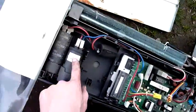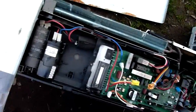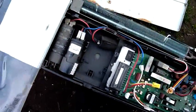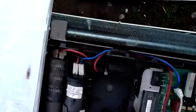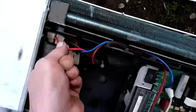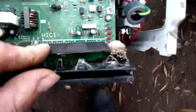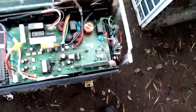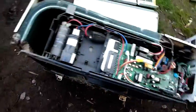Got some good caps — 180 volt, 75 microfarad, 1999. And a 400 volt 1500 microfarad Nippon Chemicon. Nippon Chemicon is pretty good stuff — it's not bulging or damaged. This thing would have suffered the same problem though: strange electrical shorts. The bottoms of the pins on that little package there are all green and nasty. Forced operation switch. Yeah, nothing worth salvaging apart from the copper and coils.